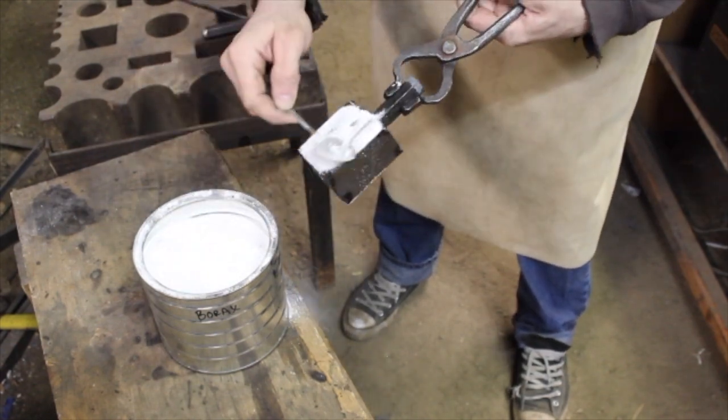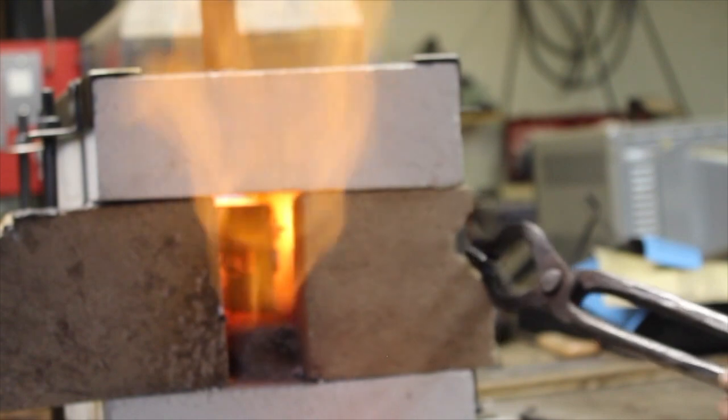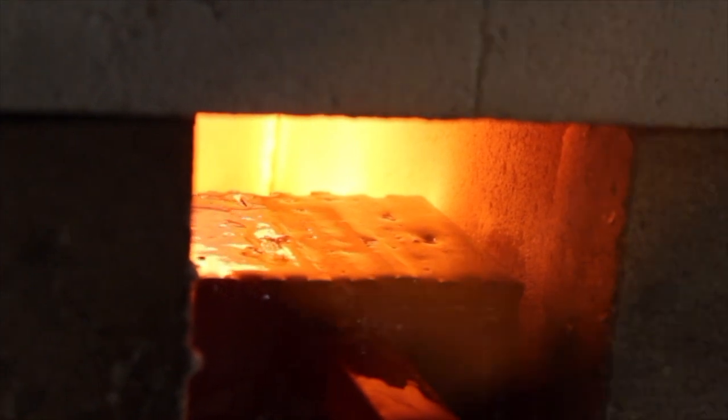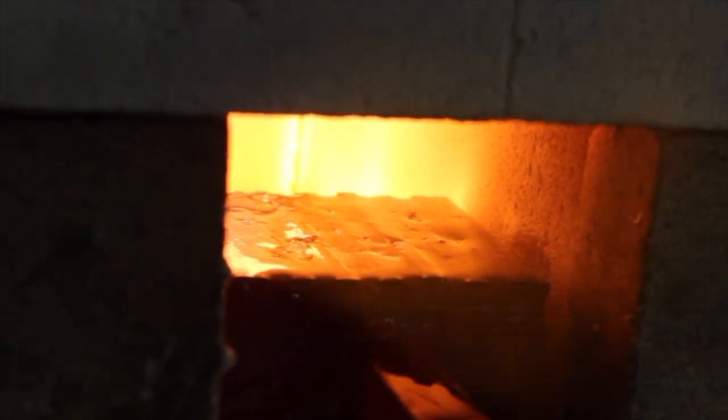To be honest, I don't really notice a huge difference. I've always been super careful about getting flux on the billet even before it will completely melt — I'm still trying it to see what I think. As this big chunk of steel heats up, I'm in and out of the forge every couple of minutes reapplying borax for flux, so that when the steel gets just hot enough to start melting it, that flux is right there and available. That's the best way I know of in a gas forge to preclude any scale formation between layers, which always does cause problems in the forge weld. Once you have a little layer of flux melted onto your steel so it can flow in between the layers, you're sort of out of the danger zone.